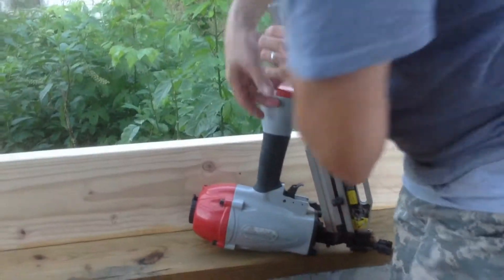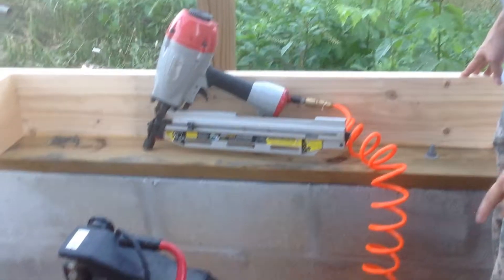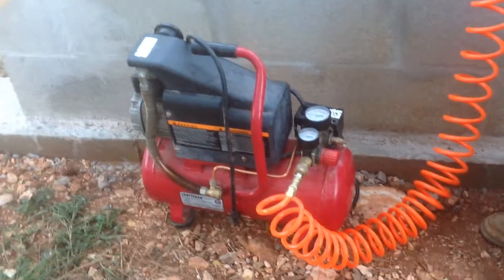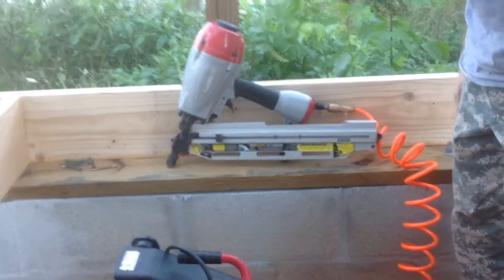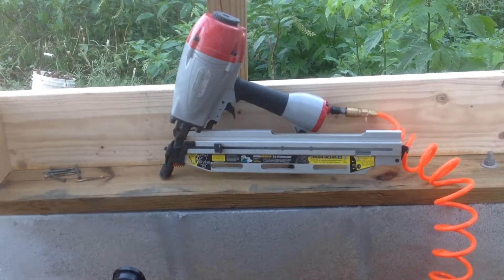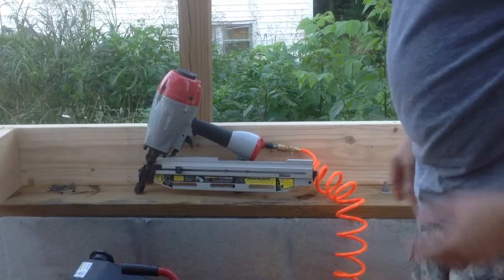You'll connect that to the air line. I'm using a very small air compressor — a 100 PSI portable unit. It really doesn't keep up with heavy framing. For small projects like what we're doing, it's fine. But when you've got a guy rapidly putting nails in one after another, it's not going to keep up because it's got to maintain 100 PSI. So you put a couple in, then give it time to pump back up. You have to be patient with it, and make sure you have electricity connected to it at all times so it'll keep filling with air.